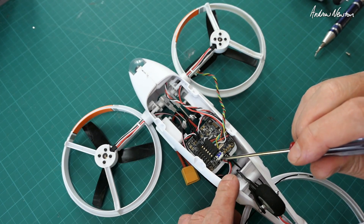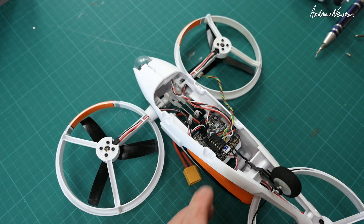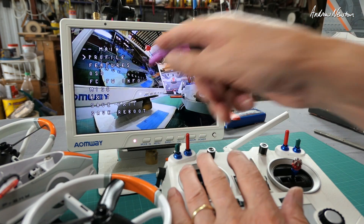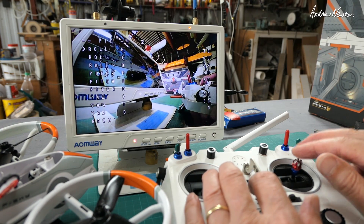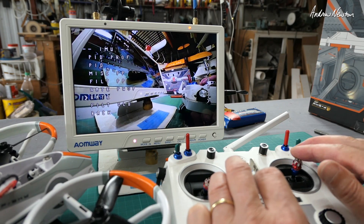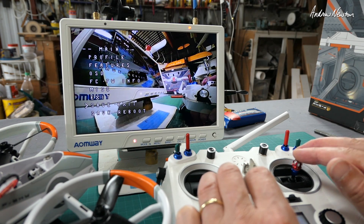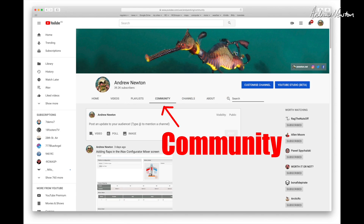You can see there's a micro USB connector there, so you can actually connect it up to your computer and configure it in Betaflight. As well as the USB connection, you can use your stick commands to bring up the on-screen display setup menu. You can change your PIDs and everything on the screen there, and all the other goodies — rates, filtering. You can get yourself into a lot of trouble there, but if you know what you're doing, you can tweak it in Betaflight in the field.